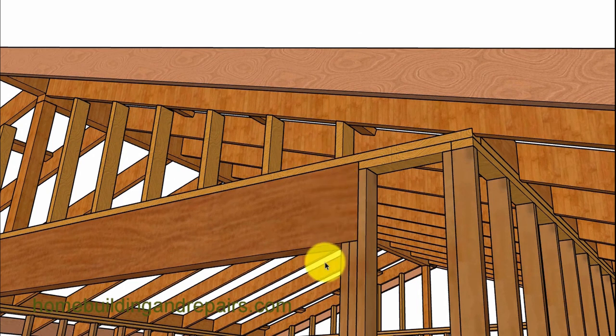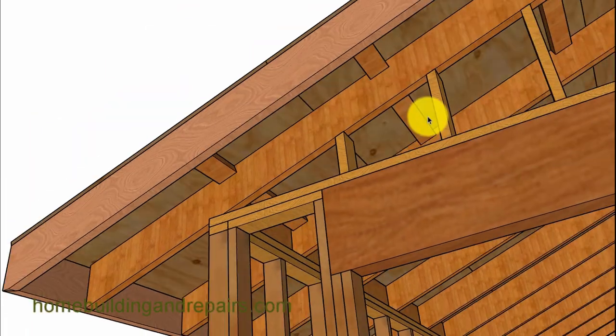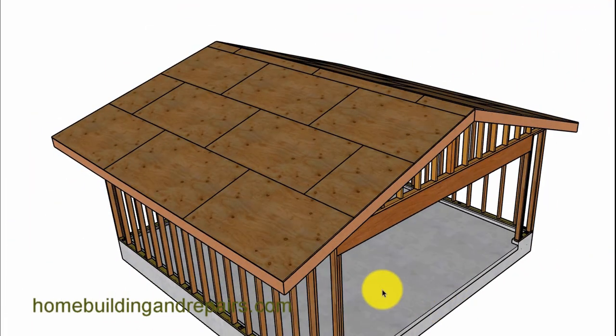Now, if you use a 4x14 to get the garage door opening to work, you might need to raise it a little higher, and that might require notching the plate like we're looking at here. The top plate is going to be able to nail into the garage door header and nail into the wall here, and of course tie to this wall. So this plate will provide you with a nice structural connection.